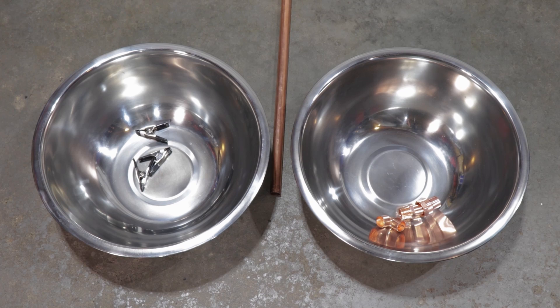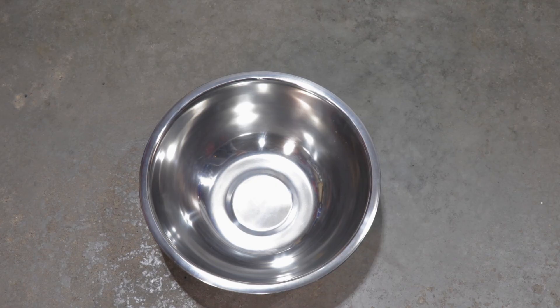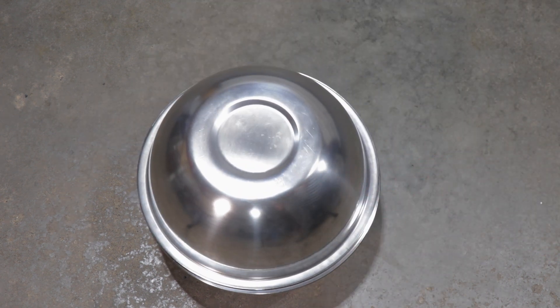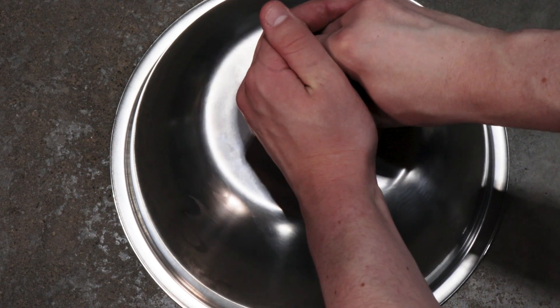In this video we're going to be taking two bowls, some copper tube and copper fittings and seeing if we can distill some water with it. The idea is that dollar store bowls are really cheap, and if you flip the two on top of each other you basically get a boiler — the bottom pan holds your water and the top funnels the steam. In order to let the steam through we need to add a hole, and that's where I'm going to attach my fitting.